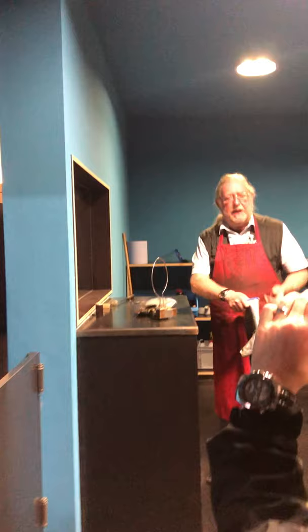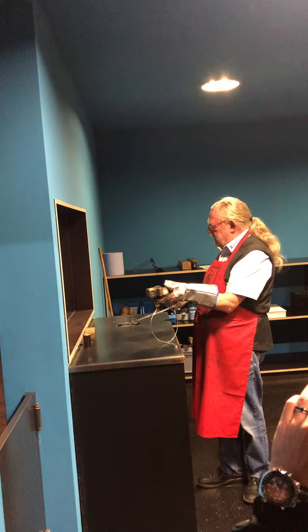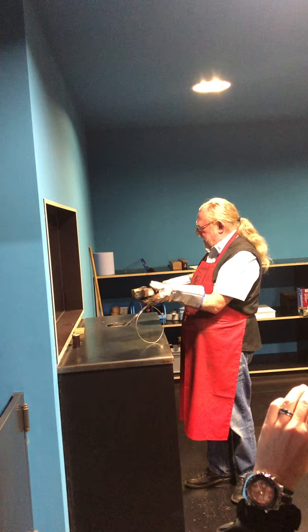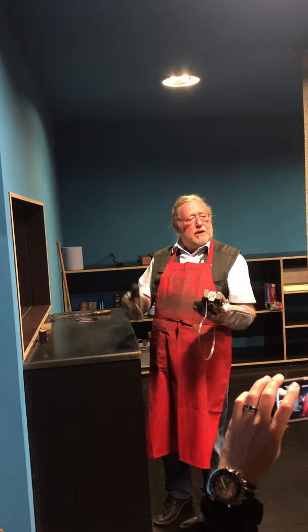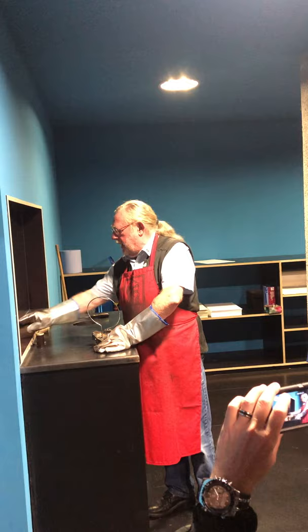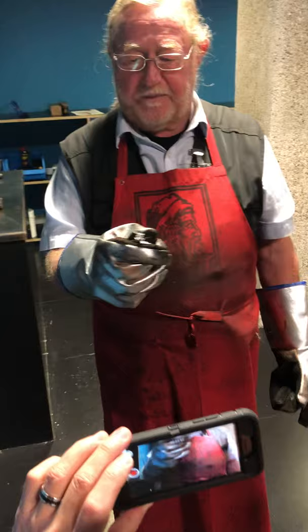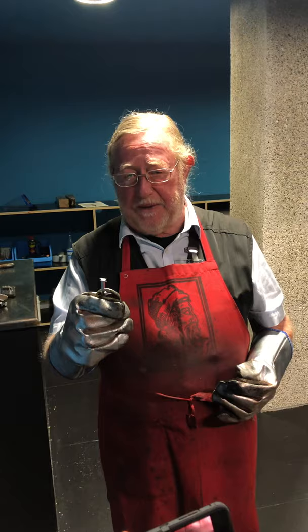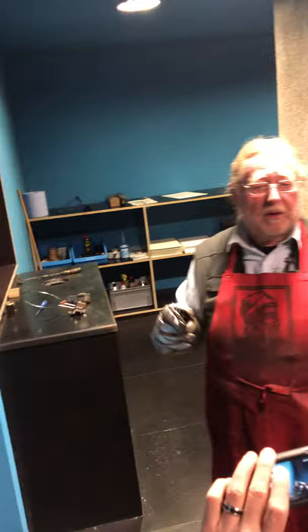As the metal is liquid — it's three times as hot as boiling water — I put on the gloves. In one hand I take the hand mold with the opening on top. With the spoon I get the little metal out of this little oven we have here, and pour it into the top of the hand mold. As soon as I have done it, it is already hard. I can open the hand mold, and out comes one character. Now you have the G on there. Gutenberg could produce with his little machine around 15 characters per minute, one exactly like the other.